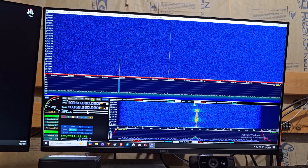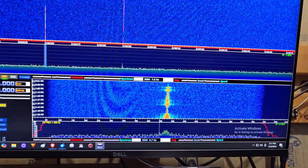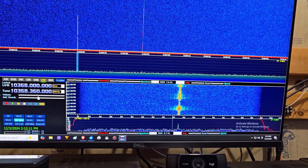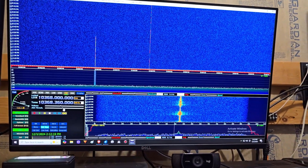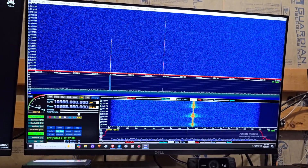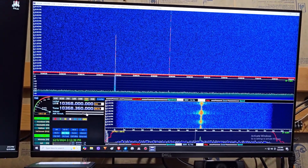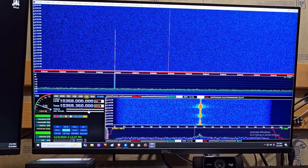The little synthesizer board does the keying automatically on board, which is very convenient, but it's not the greatest keying. If the signal were stronger you could really hear the key clicks — you can kind of see evidence of them on the waterfall during the keying part, with green extending out the sides. That beacon is running about 5 milliwatts on an indoor antenna, blocked by the building and trees on the hill, so it's pretty weak. But if the signal were strong, the key clicks are kind of bad. Also, the phase noise is only about 45 dB down at 10 kHz or so off the carrier, and even at 100 kHz off it's not great. Not thrilled with these synthesizers as a beacon — they do work, they were very affordable, but just not what I set out to build. Unfortunately there don't seem to be any strong in-band or out-of-band spurs, so it does work.